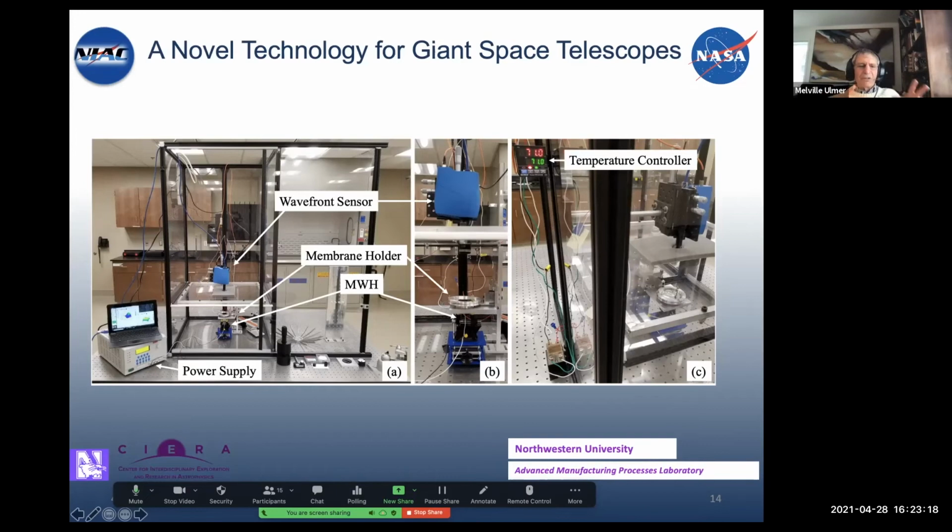is at what's called a wavefront sensor. The wavefront sensor shines a laser beam onto the test substrate we're working on, and then the light gets reflected back up through some magic system, and then that image that bounces off the test substrate is compared to a reference image. So what we do actually is we take a shot of the surface, store that as our reference, turn on the electromagnet and turn it off, and then look for the difference.